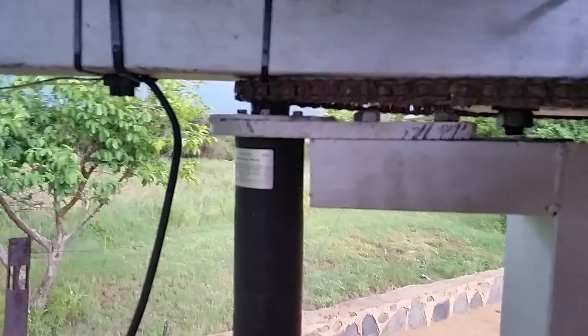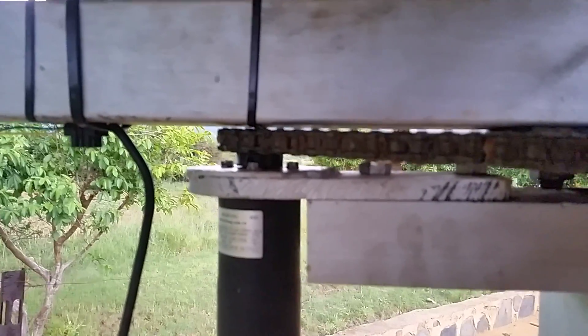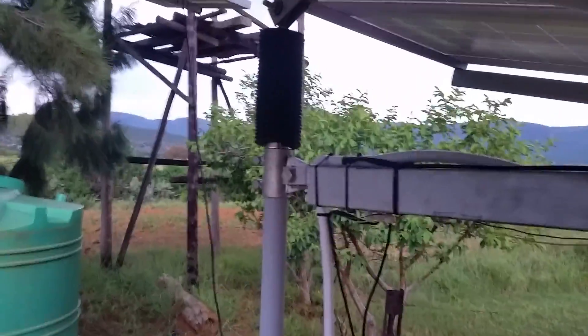You can see this is where everything is bolted on. This is a normal truck wheel hub. I can't turn it now because the gear ratio on that motor is one to five hundred and fifty-seven. It's bolted to a normal sprocket, with a chain to that small gear motor also via sprocket and chain, and this turns the whole system.